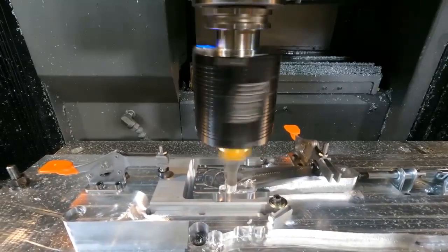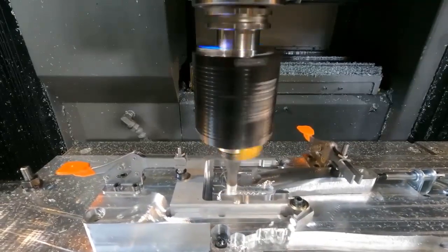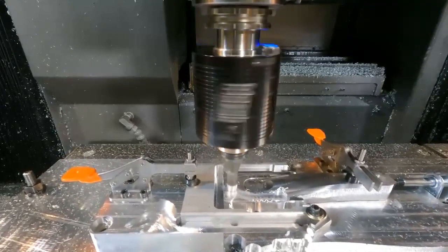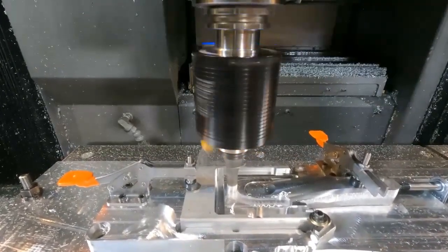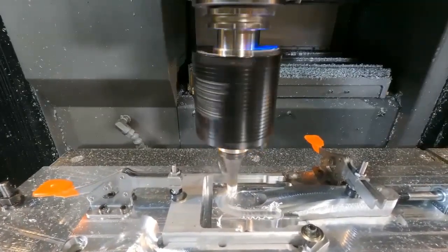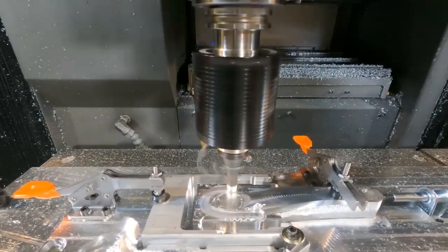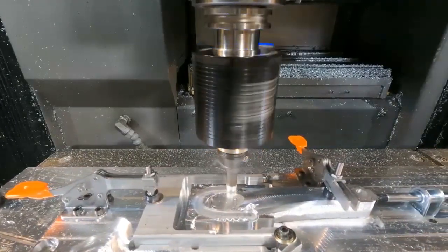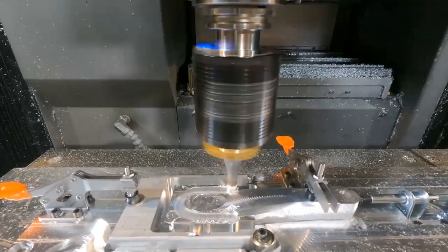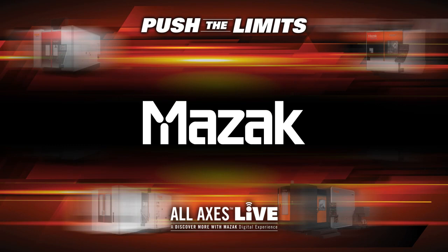It's a very simple process — we just plunge in, we're spinning, and we join these two together. We program in the joint line just like we would in a typical CAM fashion. This system also records all the data files for us to go back and analyze later and to inspect for weld quality. Thank you for the opportunity to present today — if you have any questions, feel free to get in contact with myself or Mazak.